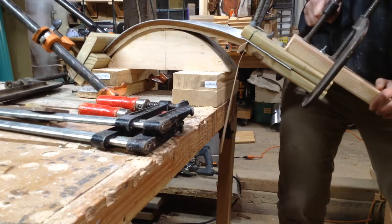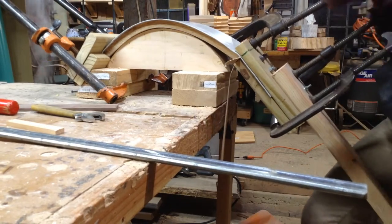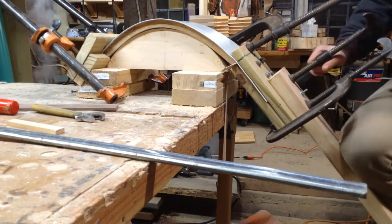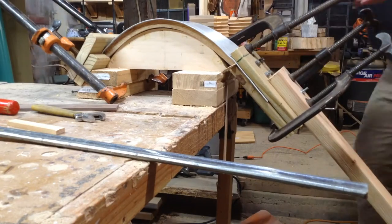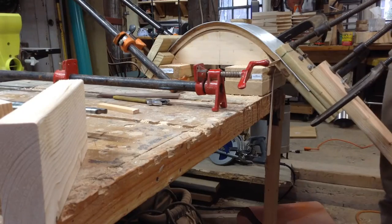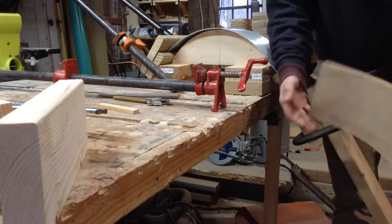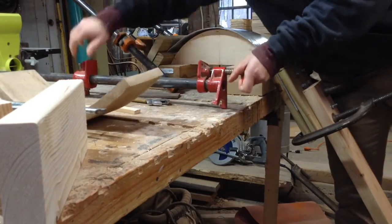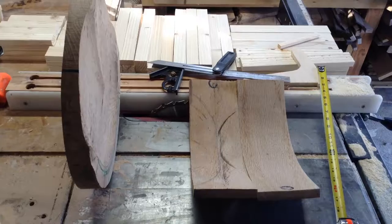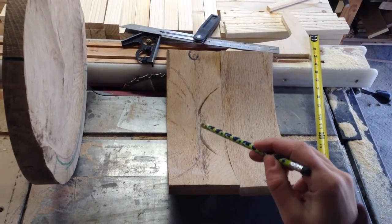After steam bending, my piece — about five inches wide — went into the jig and I just pulled down on that lever to get it to bend pretty easily. The jig was also clamped because it was starting to move, and I had a really large C-clamp that once I bent it far enough let me sit on the lever and pull it back into place. The bends went pretty well and went faster because it's thinner material. I ended up with about two missed bends on this one as well. I took it out the next morning, dried them the exact same way as the legs in a pipe clamp, and let them set for about a week.